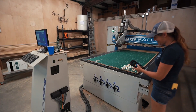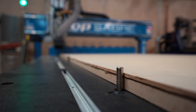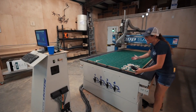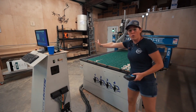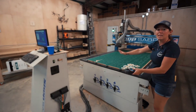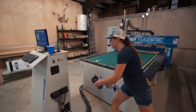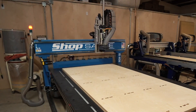Tell me that's not cool — that's like space stuff! What the reference pins do is allow you to remove the material, and then whenever you want to load it back, you pop up the pins and reference your material all the way to the bottom and all the way to the left of the machine. So if I wanted to cut 50 of the same piece, I can make sure they're all in the exact same spot.